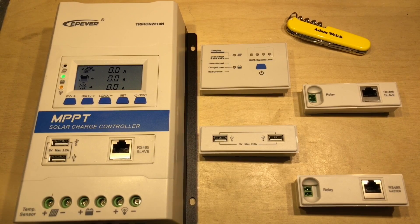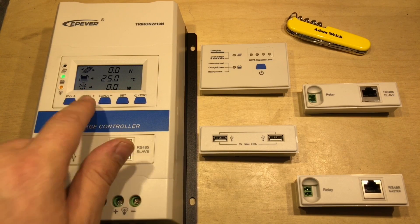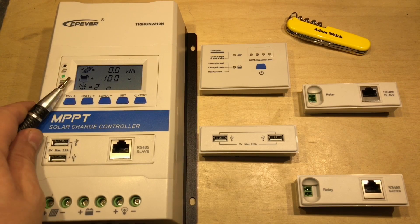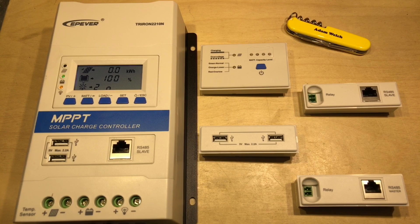After my first test, the Triron solar charge controller seems a fairly capable unit. The DS2 screen shows a lot of information clearly, and the addition of a backlight is very welcome. It's a shame that even with the top-spec screen you can't change battery charging parameters or battery chemistry to lithium, despite that being officially supported. It's also a little disappointing that EP-Ever continues with the slightly peculiar state of charge meter, which only shows full when the battery is actively being charged. However, if you're already an EP-Ever customer, it's great that existing accessories are still supported by new models. I managed to get over 90% conversion efficiency and expect this would improve at higher power levels — all in all, I'm really impressed.